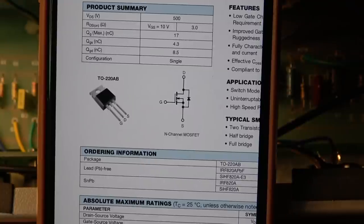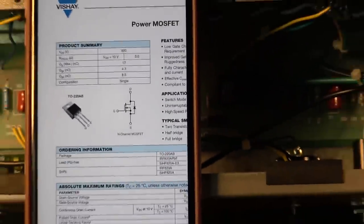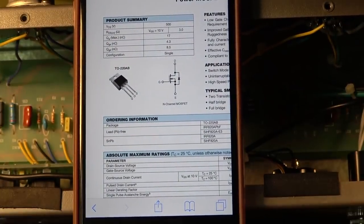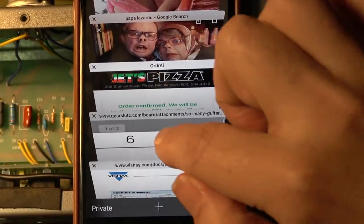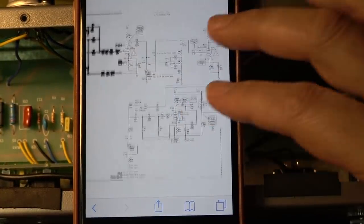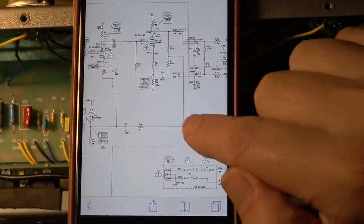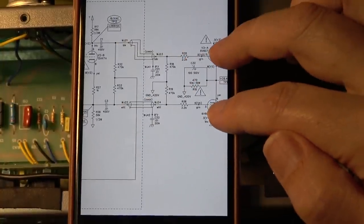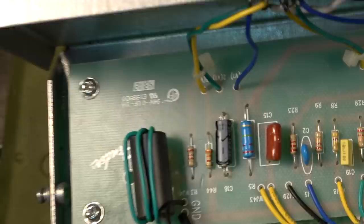So one half of the 12, this probably, the second tube, I think it's the second tube. One half of this tube is the oscillator, and then this pumps up that signal so that it can more easily adjust the bias. And the way that it adjusts the bias is kind of like what I was talking about. It adjusts the output tube bias by adjusting the grid voltage.